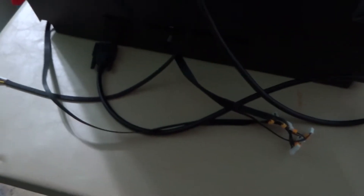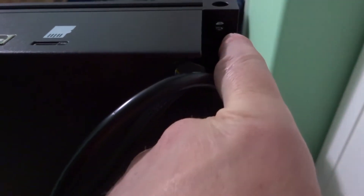One other thing I want to point out: when you set the unit up on its edge to make installing some of these items easier, make sure that the cables coming out of the corners are not pinched, pulled, or caught underneath the machine. We don't want to pull them out of the control board in the base or damage these cables. Use a little caution as you're flipping the unit back and forth. The large rod is going to go here and the screw comes in from the bottom, so the easiest way to do this is on the side.